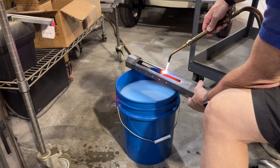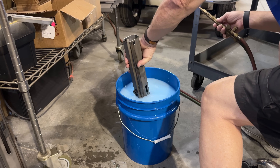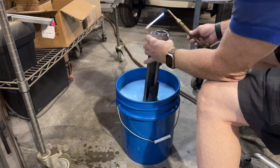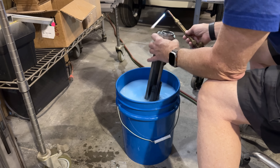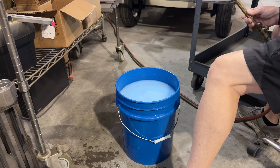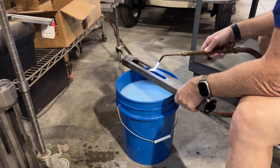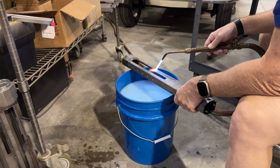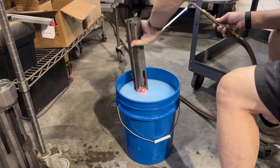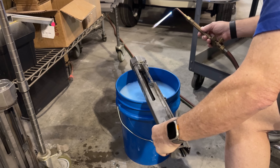I'm purely doing it here by color, because I've done this a lot. An interesting fact is when you're heat treating steel, you get to something called the austenization point — and that is an austenization temperature. That word austenite also refers to a type of stainless steel, which is austenitic stainless steel, 300 series or non-magnetic. The interesting thing is a way to tell if the steel has got to the austenization point is if you took a magnet to that hot part right now, a magnet wouldn't stick to it because it's austenite, which is non-magnetic. So it gets to be non-magnetic, but once you quench it, it's magnetic again. I really should get a magnet here and try it, but I think it'll get burned.